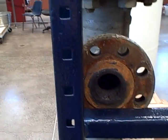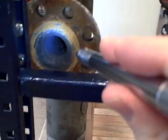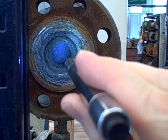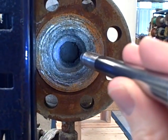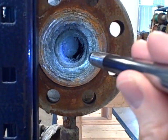This is a displacer instrument, so inside this cage assembly you can see a displacer — there's actually a round metal piece called the displacer. Some people call it a float, but float is actually not the proper term. It technically does not float on the liquid level; instead it just hangs within the liquid and experiences a buoyant force that's proportional to the level.